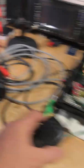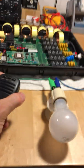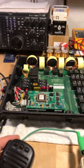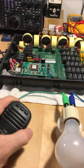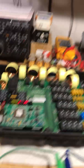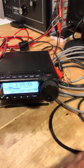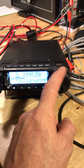Nonetheless it remembered it. Let's go over to 80 meters and see what happens. Same thing — really high SWR, the third LED shows greater than 2-to-1. If I hold it down, we'll see how long it takes to query memory and try to rectify it. Thousand one, thousand two, thousand three, thousand four, thousand five — five seconds — then click click. It must have recalled something from memory, less than 2-to-1. Not ideal; I would have expected better.